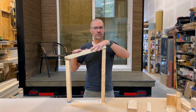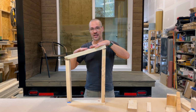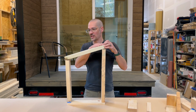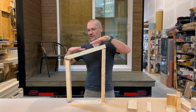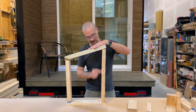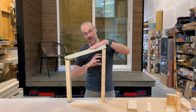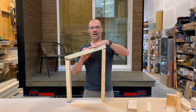We use metal roofs, which can be done successfully down to very low slopes, depending on the way that you do it. And there's ways to make sure. We do entire peel and stick storm barrier underneath. So low slopes are not a challenge for the way that we build. So you get this big, huge volume inside, and a tall wall that you can put very tall windows in. You can put double layers of windows in.